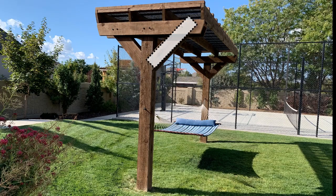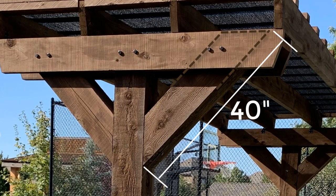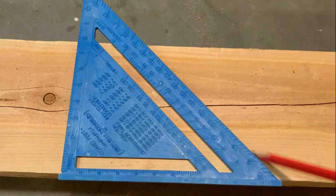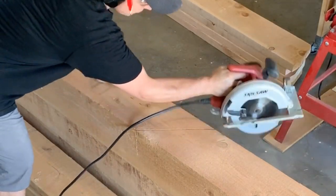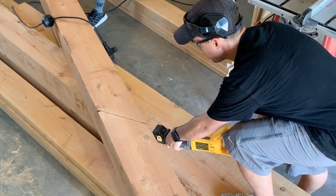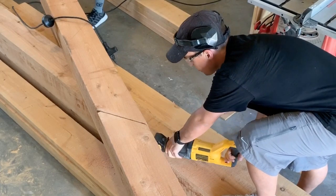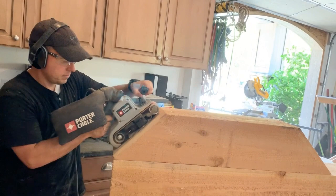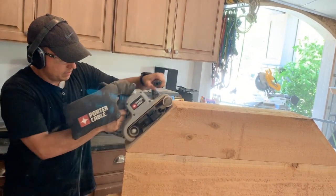The next piece is the angled support. This is an 8x8 piece and it's 40 inches long from tip to tip. We've cut this piece at a 45-degree angle on both ends. We did that by marking it and then cutting it with a circular saw. These pieces are so thick you're probably going to have to cut it on one side, then flip it over and cut the other side, and then use another saw to get the very center cut. If your cuts don't perfectly match up and it leaves a little ridge, just sand that as flat as you can — it's really not a big deal.